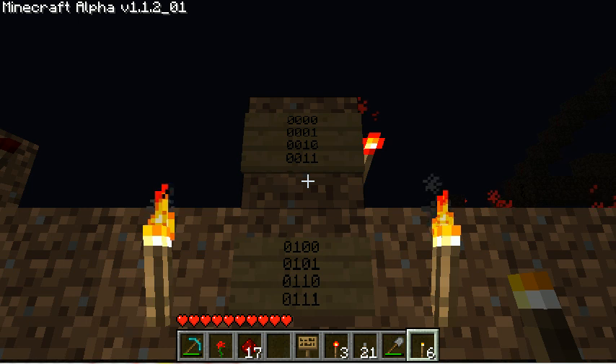By wiring these flip-flops in series, once the flip-flop controlling bit 1 goes on and then off again, it turns on the second toggle. Then when the second one goes off, the third one comes on, and it keeps going on and on that way. By the time the fourth bit goes on, the first bit — which is the 1 — has gone off and on again a total of 8 times. Bit 2 has done it 4 times and bit 3 has done it twice. Which, if you do the math, makes sense.